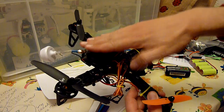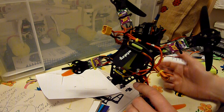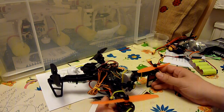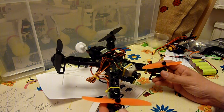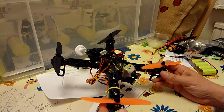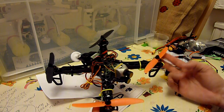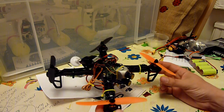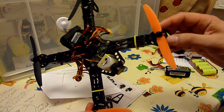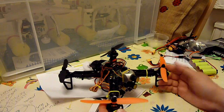The video transmitter I've just put on there, and the RC receiver is underneath — doesn't seem to be any issue there at all, it flies really well. The performance I'm really pleased with, it climbs pretty quickly, it's certainly exactly what I want. I've crashed it five or six times already and all I'm breaking is this front left prop. I broke two, and then fitting this one I was a bit heavy-handed and I've actually got a little fatigue crack there, so I'll probably fly this one for a bit.